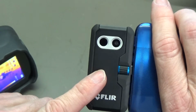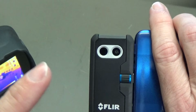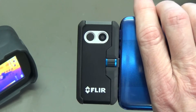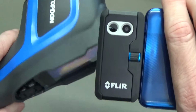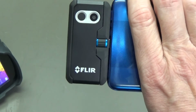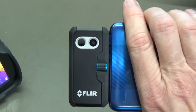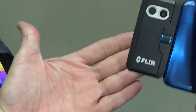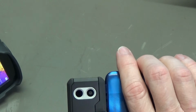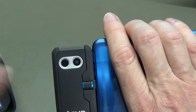So generally speaking, that is already a good camera, so that is not bad. You would expect to get good pictures from the little FLIR as well, and I can assure you we do get good pictures. Then the third feature we talked about in comparison to the TOPDON is the frame rate, and we have with the little FLIR only 8.7 Hertz, and that is a little bit slow, because if you move the camera very fast, the frame update can't follow fast movements, right? Anyway, let us have a direct look when we take the TOPDON and the little FLIR, and we can compare what we see.